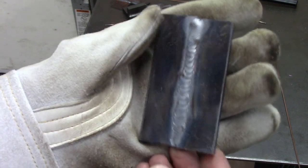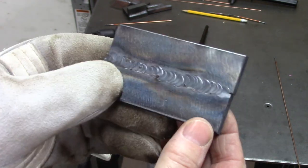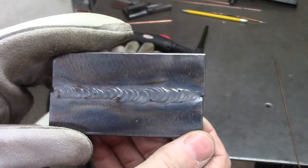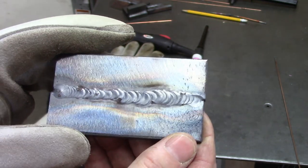Okay, there's what I got. It was okay — that's nothing to brag about. Guaranteed a good weld, but I think I was running a little bit cool. We're going to bump the amperage up to 165 and try it again on the backside.